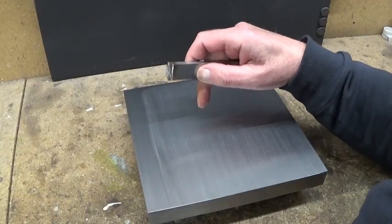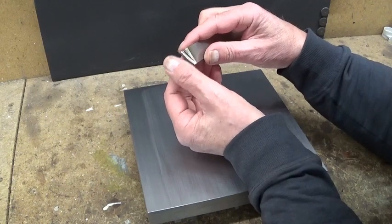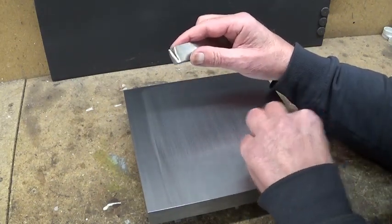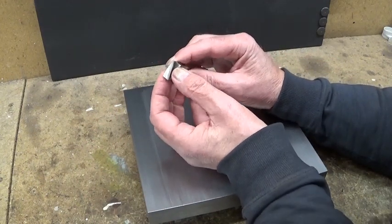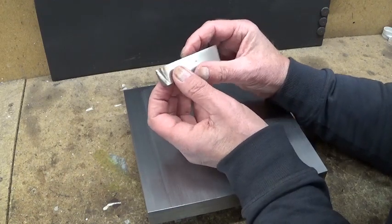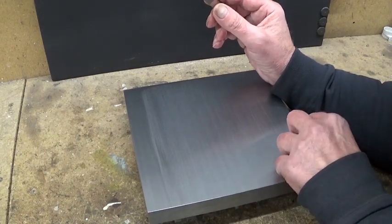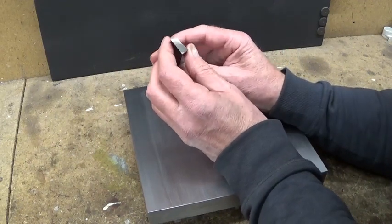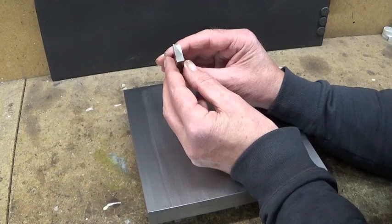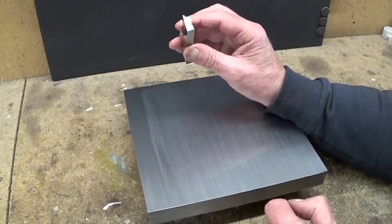I took one roughing pass and then I had to regrind the tool because the cutting edge was a little bit dull again. And then I took a finishing pass and a spring pass in the other direction, and we see that the tool, of course, camera you cannot see it, but I see a little flat spot in here. So for making these big cuts, to cut this surface, this is 2100 strokes, of course. So the tool doesn't stand too well. I think this is good to make roughing tools, but as a shear tool, it's maybe not terrible. Well, it could be good for smaller parts, but for this big thing, it's not terrible.